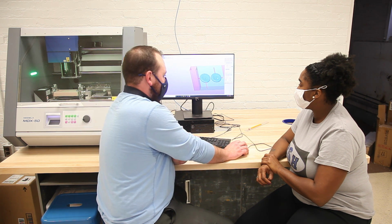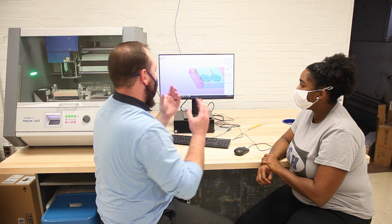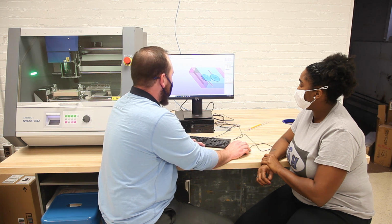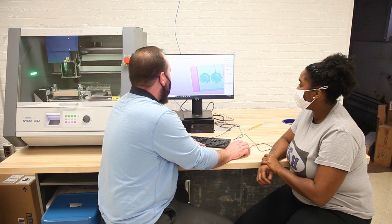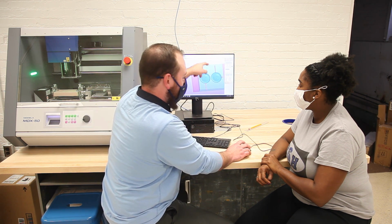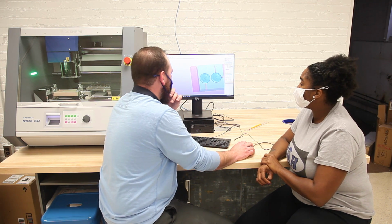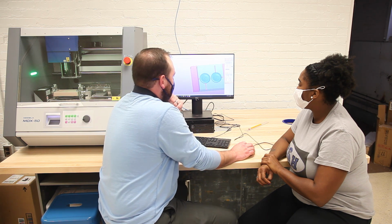This model represents what's going to be left inside of it. The red you see is where the vise grabs onto the edge. That's where that red is in this picture. And the green is everything that will be removed, for the most part. It's only going to actually probably cut off to about here, because it doesn't need to remove all of that. And also the supports have to have somewhere to attach to. So the next thing we'll do is we'll come here and hit Create Toolpath.